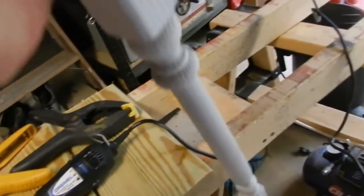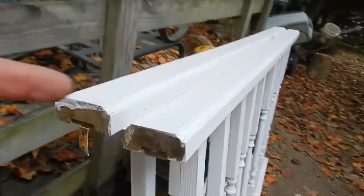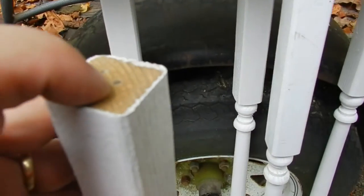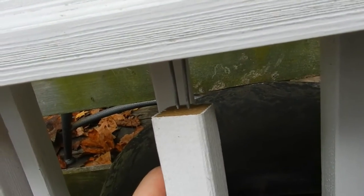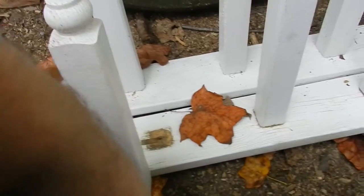Something I didn't show you when I pulled this off — we have two holes in the end. The top rail here has two pieces that come apart. What you need to do is come in here and find the small center one and the one off to the side, and kind of push this up inside — get them in there and push them up. Once they get all the way up it should match. You might need two hands to do this. Once that's up all the way in there, the bottom's going to slide in and you'll have to put a screw in the bottom. Just work your way up, and when I'm done I'll show you when it's all finished.